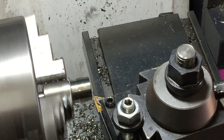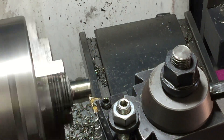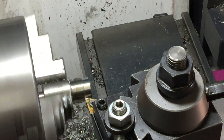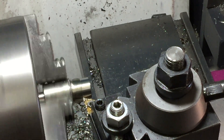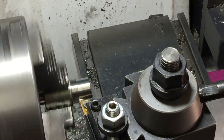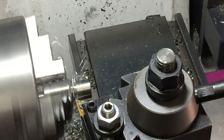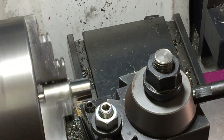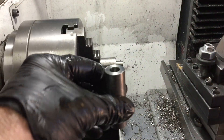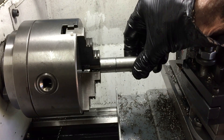There are times when I want the rotary table centered with the mill quill, so I'm making a little tool here that makes it easy to center up the rotary table with the mill quill. I'm going to turn down a bit of stainless steel — one piece will have a post at each end, and I'm making the posts different sizes so it's easy to tell which is which. I'm turning down the larger post at 12mm because that's the most common end mill I use, and the other piece just has a hole in it — and yes, it fits beautifully, no slop.